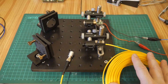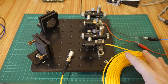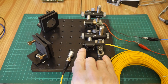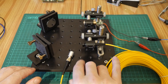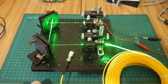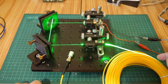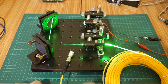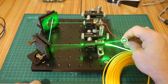When we want to couple light into a single-mode cable like this 35-meter length of telecoms cable, we need to make sure that the laser we're using has exceptional beam quality. The core diameter is only 9 microns, so we need to focus our laser light into a 9 micron spot on the end of the cable, and this is not trivial even with this setup. It's the same setup as before — still two mirrors to steer the beam into the end of the coupler, it just takes a little more time to finesse the beam and get maximum output power. We can see our beam being injected into the end of the fiber, and already there's a considerable amount of light leaking out of the first 12 inches or so of fiber because some of that light is being coupled down the actual cladding layer. That said, we've got a very nice collimated beam coming out of the end of the fiber.